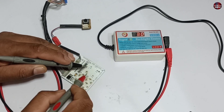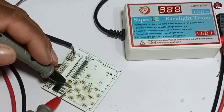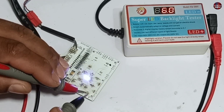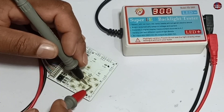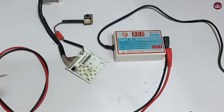All the LED lights in this circuit are 3 volts. Checking the next ones — this one is okay, this next LED is also okay. This LED is not glowing on either polarity, which means it is bad. The next is okay. This LED is bad. So I have checked all the LED lights in this circuit.